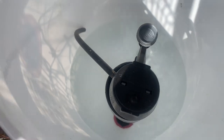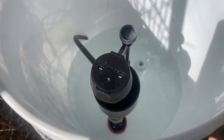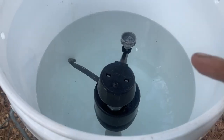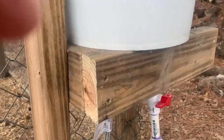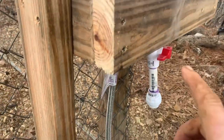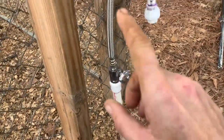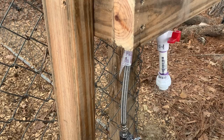This valve is off. All right, we're filling up. I'm going to check and make sure this shuts off when it should and make sure there are no leaks underneath. The float valve worked — it just shut down. Now, I'm not going to hold this water in there; that was just for test purposes, making sure there are no leaks. Now I want to flush this out — I don't want the chemicals from this pipe cleaner and glue to be in this water for our chickens.